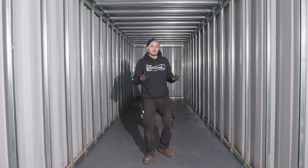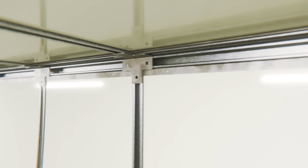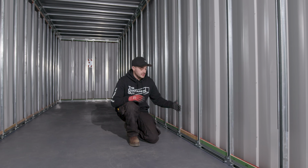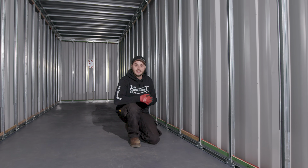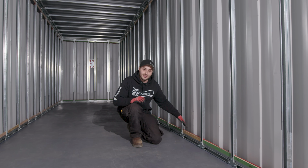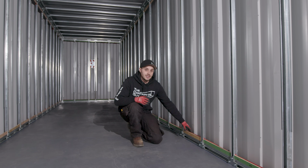So here it is. This is round 2 of this strut framing method with this baseboard and crown mold that I like to call it. It is a slightly different method than our previous version, and what we did here is we actually have the front lip. We've eliminated the PVC J that's required for these PVC panels by just bringing this galvanized forward. We got a bunch of galv here anyway. Why not just continue that look? But what we did on a previous version is we didn't tell our spray foamers to tape that all off, and it ended up being a huge job having to chisel all that away. So this time around, we got a little bit smarter.